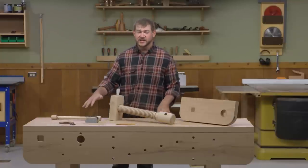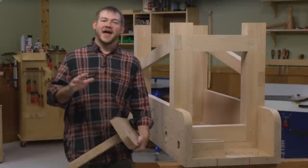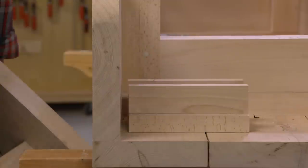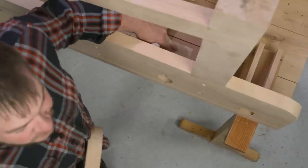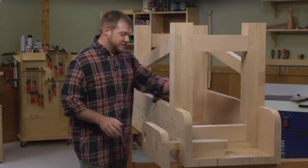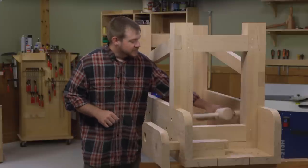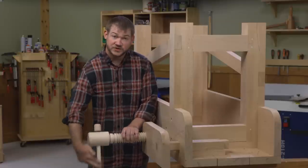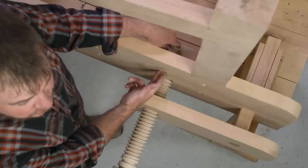You could attach all of this with the bench standing up, but for a better view we'll grab a couple of sawhorses and flip it over. With the bench upside down, I installed a guide block that will guide the support arm as the vise works in and out and keep it from binding. I also installed the maple nut for the wooden screw. A couple of things to watch out for: the nut may need to be trimmed down to fit, and before you attach it, insert the vise and start threading in the wood screw to make sure everything is aligned and not binding.